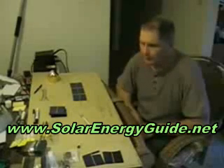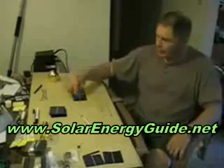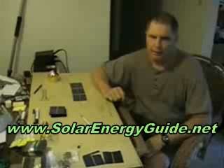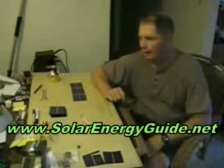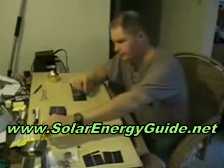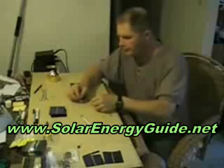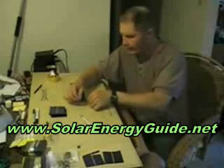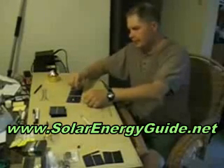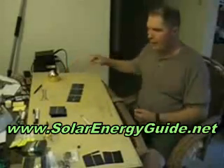I'm not an expert, but I followed directions on somebody else's stuff. They said you've got to tin the wire, and then you put it on there and run it with the flux underneath, and it works real well. The problem I found is that I'd get too much solder on the whole thing — it was more of a mess and hard to take off. You have to take your time, let the heat heat up the wire. Use this tool to take the wire like this, then slide the wire. You can rotate it a little bit so you have some grip. Then you heat it, and as you heat it, you pull up on the wire and run the iron backwards — and it'll just pull the wire right up off the top.